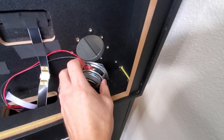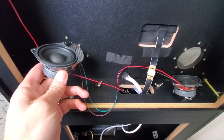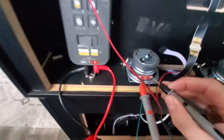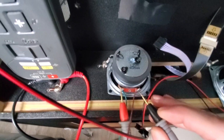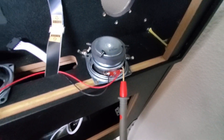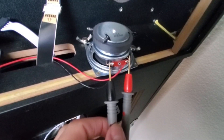And to remove the speakers, it's really easy to do — they just come right off. You do have to desolder them. Now, if you're going to test your speakers, it says right back here you should have four ohms. This is a five watt. And right here I'm reading four ohms, so this is good. Let's go ahead and check the other one — and that is four ohms as well.